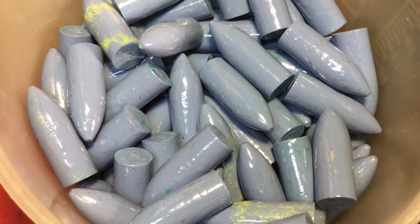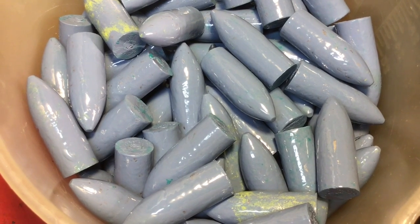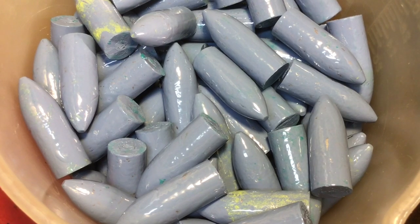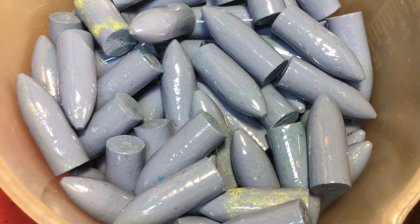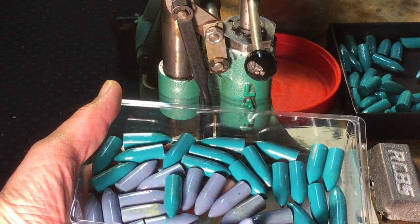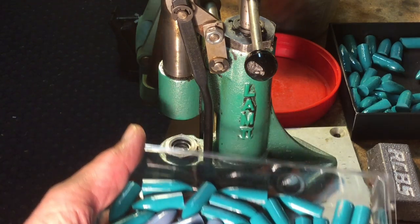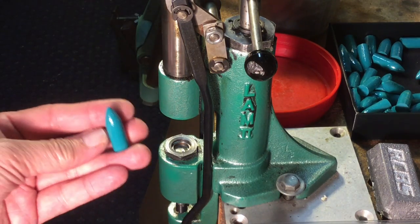Fortune cookie 45 LC coming to you from the hot lead zone. These 459 500-grain bullets are cast hard for maximum penetration — they are at BHN 18 base alloy and water quenched, probably to BHN 21. What we're doing now is sizing those powder-coated bullets for the 459 500-grain bullets cast from the NOE mold.